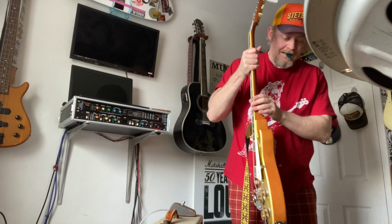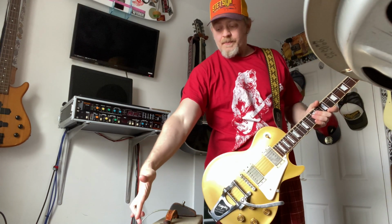Okay, so I've done that. I've hooked the speaker alligator clip, sorry, to the speaker terminals on the other one. So basically what you do is you don't need to put anything in the back of this amp now. No input, no nothing. The alligator clips coming from the reverb pan, the red and the black, attach to the speaker terminals on the other amp that you're using, and then the volume on this will operate how much reverb you want.